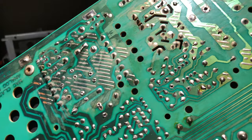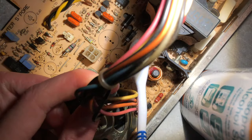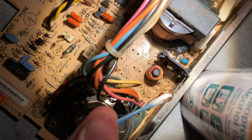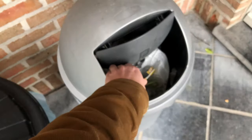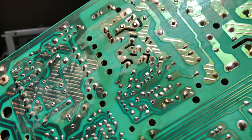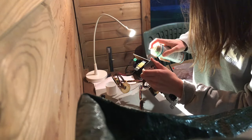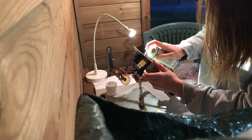After removing the capacitors, I noticed these brown stains on the board, mainly around the capacitors and legs of other components. My first guess is definitely leaking caps, but this could also be nicotine stains. I also got a lot of corrosion here. The more I cleaned it, the more dead or corroded copper and aluminium started getting off. A lot of isopropyl alcohol helped me out a bunch.